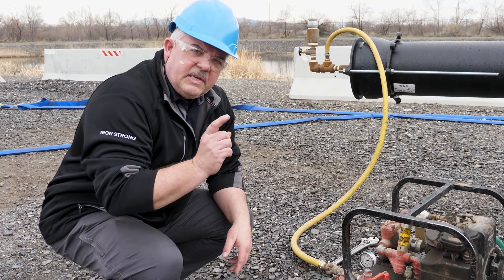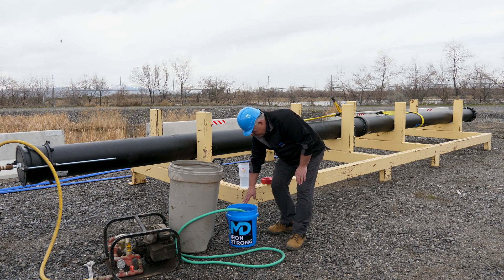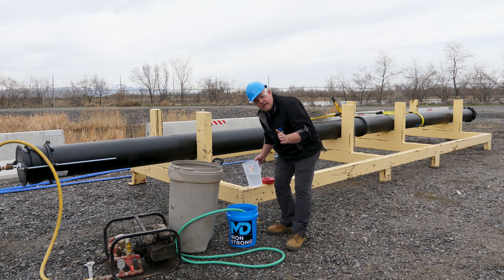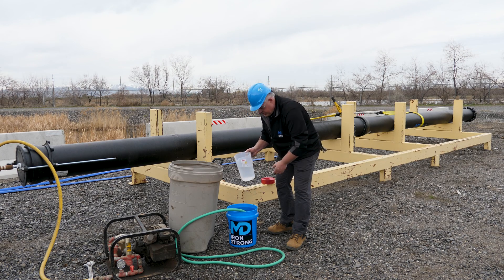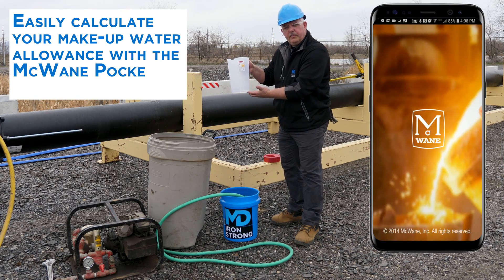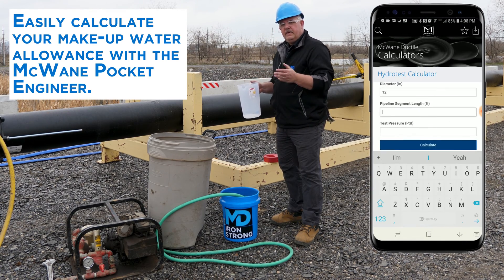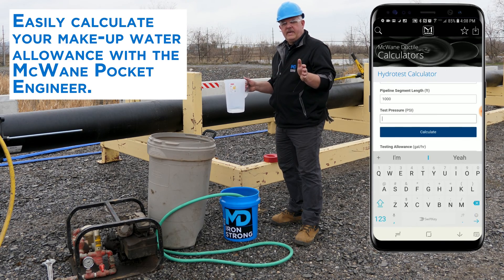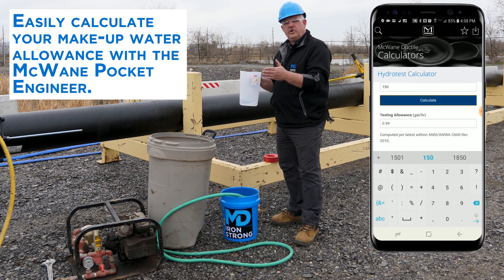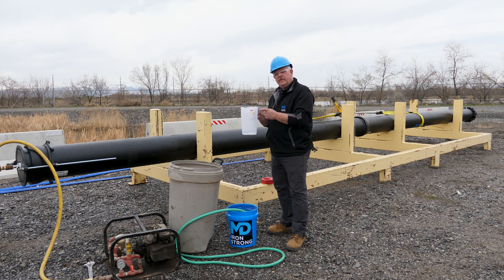Measuring the makeup water is the key to success. We can see here we started with a full bucket of water. We used a little bit of makeup water to get back to our original pressure. Now we have two quarts in this pitcher, so I can measure and refill — and I still have just a little bit of water. So I know it took less than two quarts of water to fill that pipe back up. Is that a leak? No, we did not lose any water. We just used our makeup water to get the pressure back up to the original pressure. It's all about the makeup water, not about the pressure.